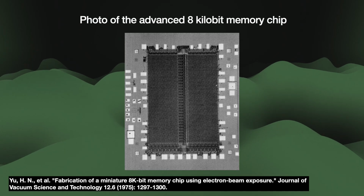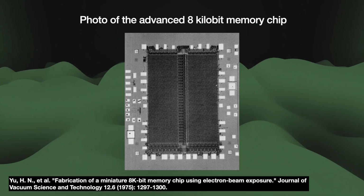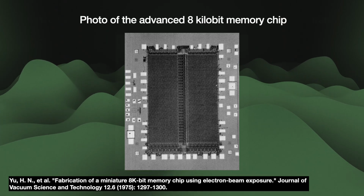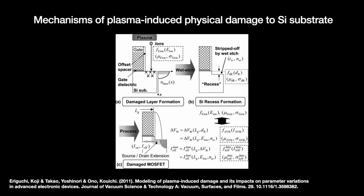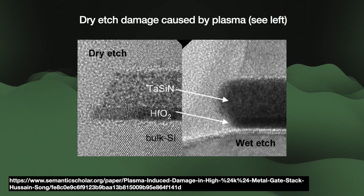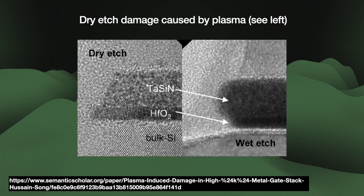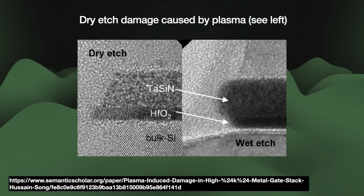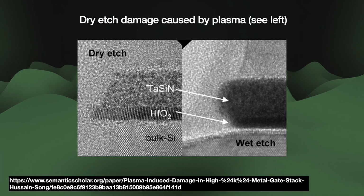Semiconductor manufacturers quickly transitioned from wet etch to dry etch, but with that, they came across two significant issues. The first involved the plasma damaging the silicon substrate and leaving residual impurities of metal or whatever have you on the substrate after finishing the etch. These damages and impurities need to be removed, so fabs added a post-etch step to do so. Post-etch cleansing might be done by blasting the damage with oxygen or hydrogen plasma, followed by a dousing of wet acid, followed then with a good old-fashioned hot bake.